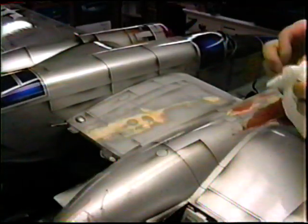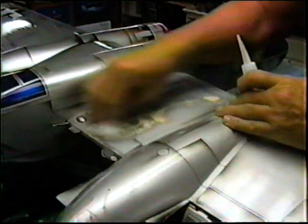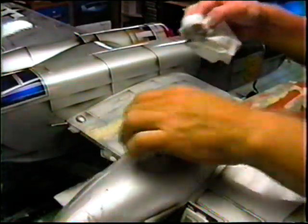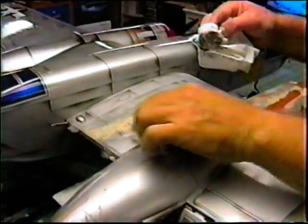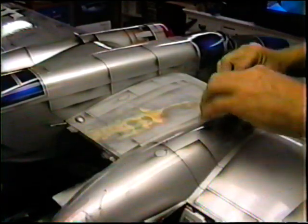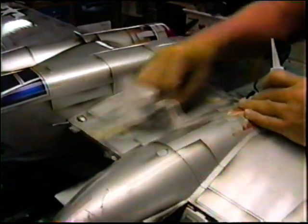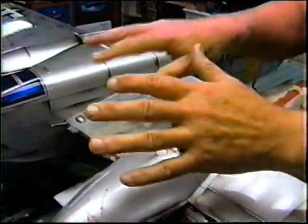Any time you're doing this kind of repair and you get down through into bare wood, I want to seal this up. The thin CA will harden up the wood, then we'll put a couple of coats, maybe five coats of thick CA on here and sand each coat. I don't want to have raw wood just with nothing holding it or hardening it up. What's nice about using this system is it goes really quickly and the wood is nice and hard when it comes time to put the fiberglass down.